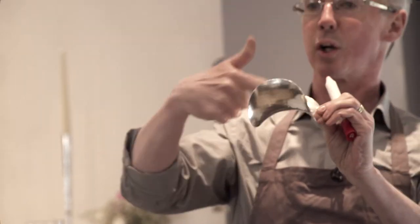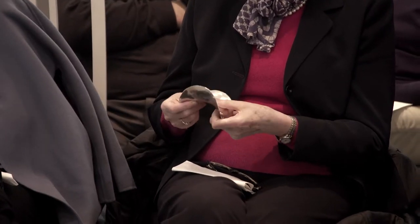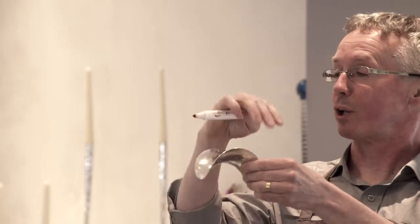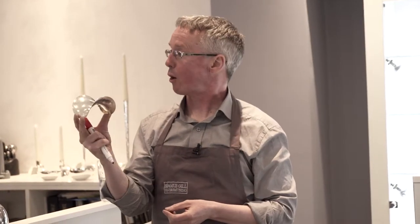The two curves are going in opposite directions. It's structurally very, very strong. That's why Pringle crisps were made that shape — because they sit on top of each other, they'll sit in a cone, they can be shipped and they don't break. A lot of modern architecture uses an anti-clastic form because all the rainwater just flows straight off it, and structurally it's very strong, so it can be made from thin sheet concrete and you can have huge spans of roofs that don't need support in them.